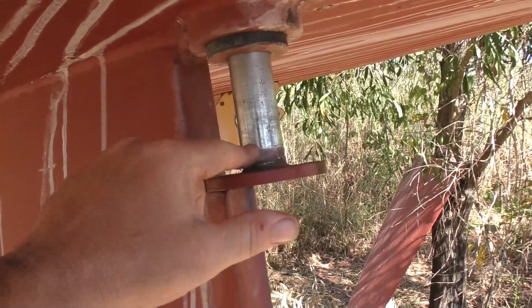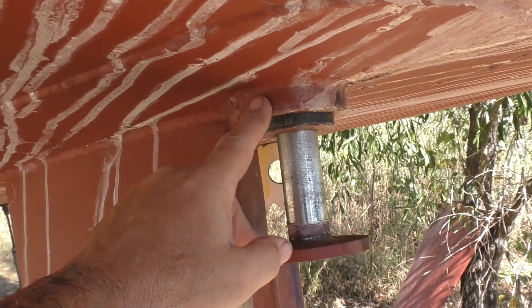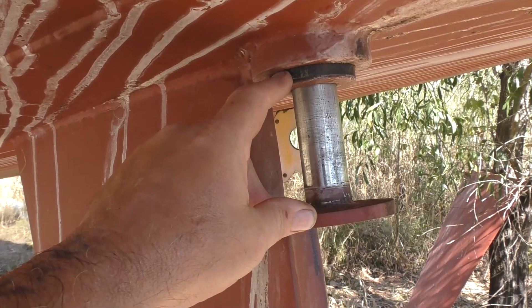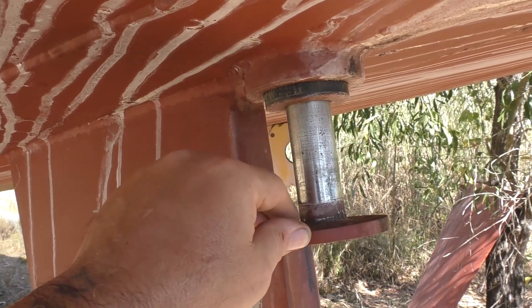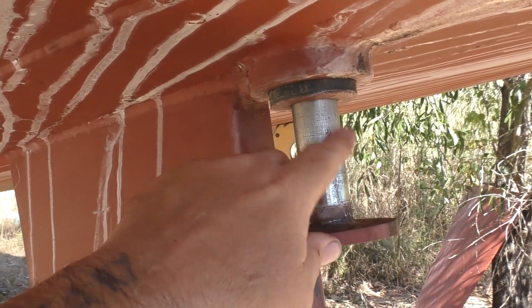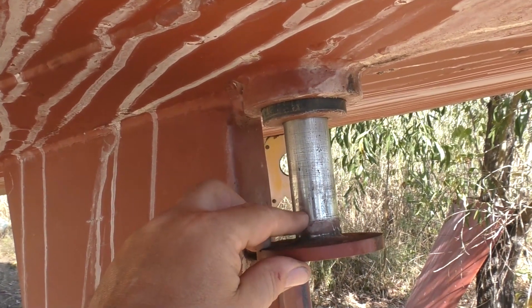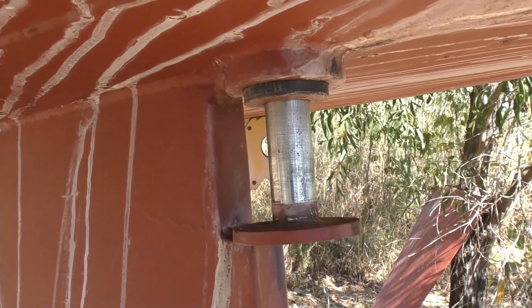Here's the rudder shaft itself — you can see the flange welded to the bottom. Here is the bottom of the rudder post coming through the hull, and you can just see about a quarter inch or more of that bottom bearing sitting there — that's how far I managed to shift it yesterday. What I'm going to do is put this little shim over the shaft to sit on top of the nylon bearing, hammer it out with a steel tube, and once it's out I can angle the shaft and slide it out from the rudder post.